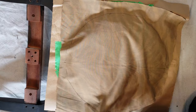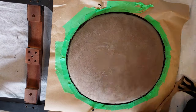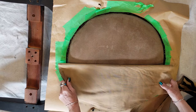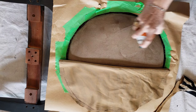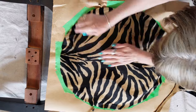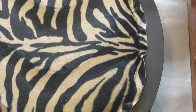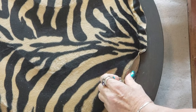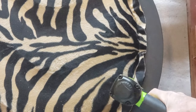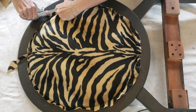I had previously placed the fabric right side down and outlined the back fabric section of the chair, then cut it out. Using the same method as we did for the seat section, I'm laying the piece of fabric over the entire back cushion and then folding back half. Apply the spray adhesive — and this is why we put the paper on to protect our paint. Fold back over the adhesive and smooth into place. Now we're going to use the stapler to staple down all of the outside edges, stapling into the crease where the previous fabric is stapled down, not into the wood. Trim away any excess fabric.